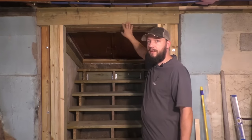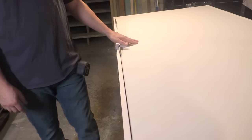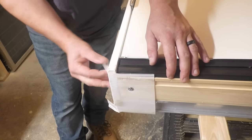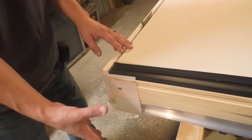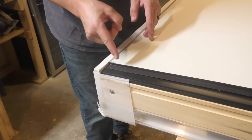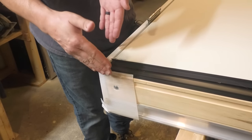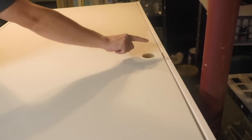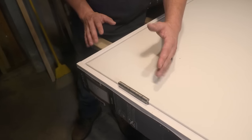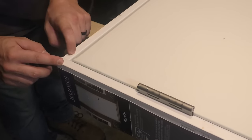I'm going to cut the door to that. I have my door laid down on my sawhorses. There are a couple different ways I could cut this down. One way would be down here — I could take this threshold off; there are a couple screws going in this way. I could take those screws out, take this threshold out, and then cut my door up here and reattach that. But that is what I want to kind of avoid, because what else is going to drop down is the doorknob, and since the hole is already here, I want to avoid that. So what I'm going to choose to do is actually take everything off of the top — that includes the frame of the door, or the jamb. I'm going to cut this piece and then reattach this piece here.